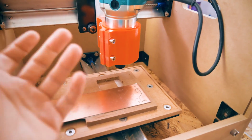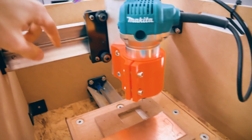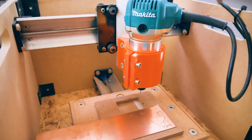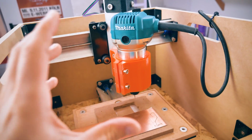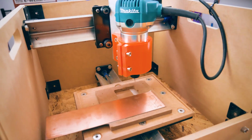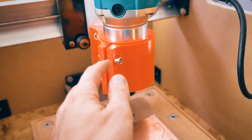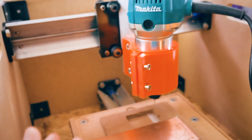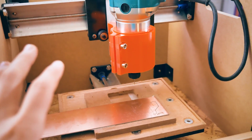And the last thing, I guess, is just mechanics in this entire setup. So the CNC is using lead screws for all 3 axes, so these by nature have a bit of slop in them. It does use spring-loaded anti-backlash collars, but it's not perfectly accurate. It's not ball screws that would have no slop at all. So it's not an absolutely precise system.